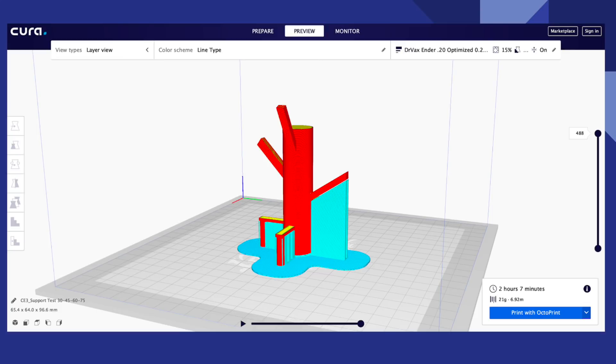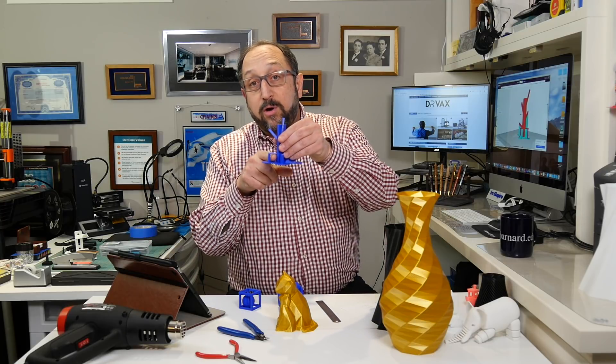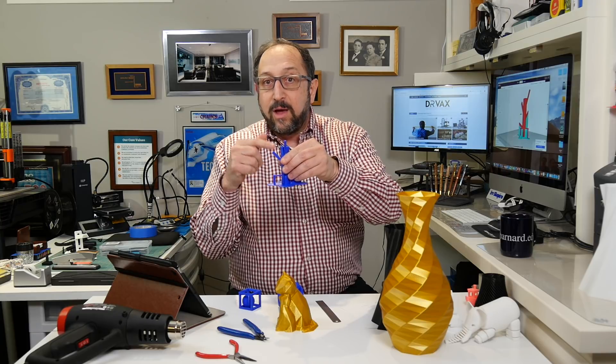Here's an example of the model loaded into Cura. I've sliced the model and I'm in preview mode — you can see where supports will be added, shown in blue. Cura also has the capability to selectively block the auto-generation of supports. To do this, click on the staircase icon on the left-hand side, then click on a red area of the model where you want to block supports, and it will add a small square there. Those squares can be dragged around to configure exactly where you block supports — I used this technique to ensure there are no supports in the bridged feature, since Cura didn't recognize it didn't need them.